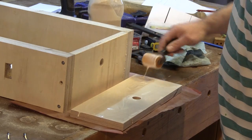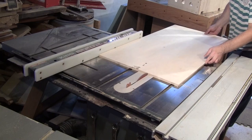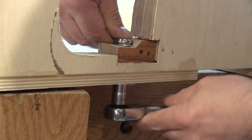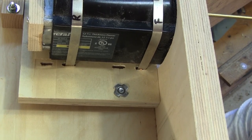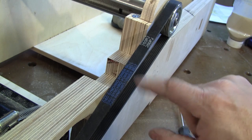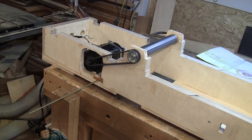Then I cut and drill all the necessary holes, glue and screw both end caps of the jointer. Then I cut both bottom panels, glue and screw them in place. Now I can firmly bolt both motor pivot blocks. When the motor is in place, I tension the belt with a bolt from under the jointer. Now that's the sound of a nicely tight belt. I couldn't stop myself — I wanted to try the cutter head. No vibration, so far it's a success.